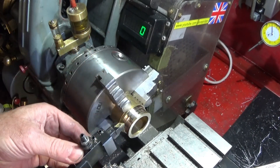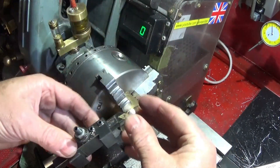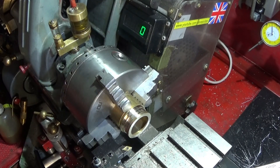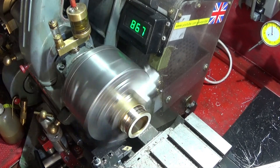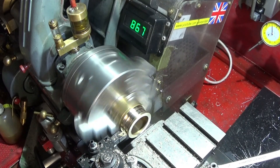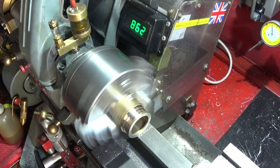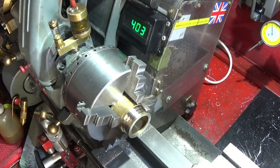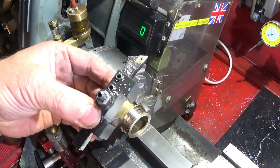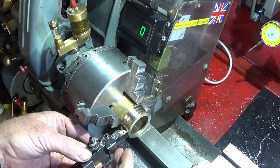Now I can use the left-handed tool — remember, hold it up that way to see which orientation it is. This left-handed tool can be used for facing down a flange, to take out the angle that the previous right-handed tool left. That's a great tool for turning to the right side of the lathe, producing certain width flanges or whatever you need.